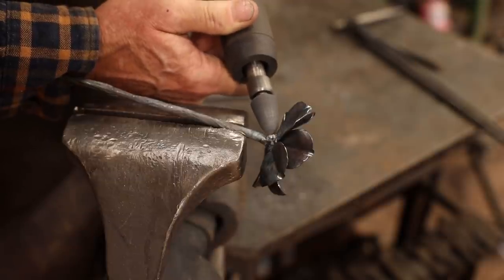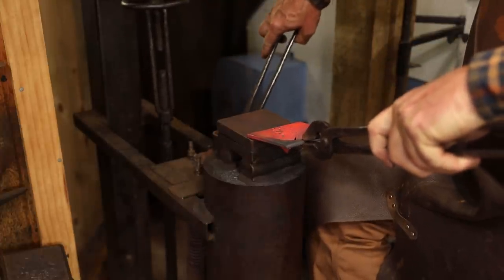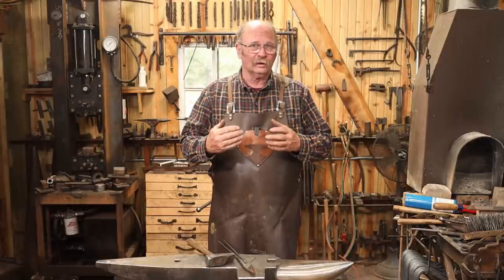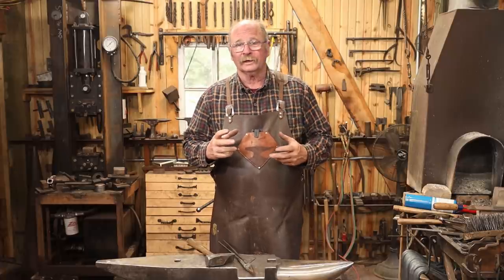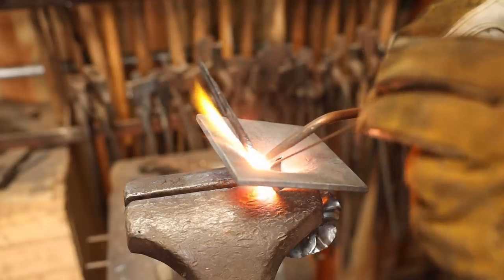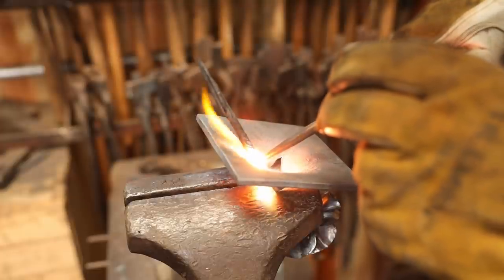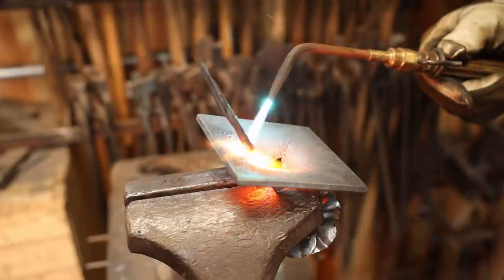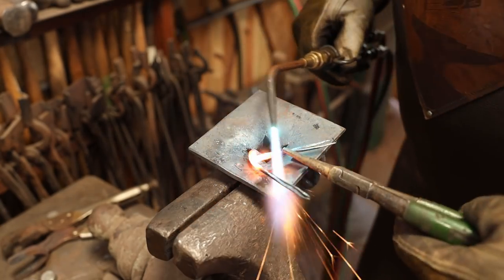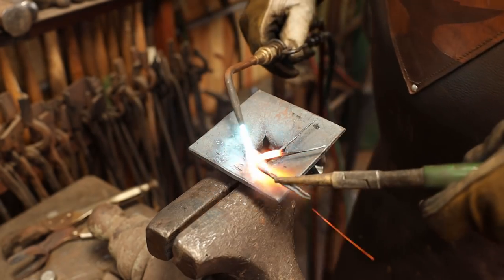I'll take just a moment with a die grinder and try to clean that weld up a little bit. I'll go ahead and add my touch mark to the plate before I weld the flower in. My original thought on how to hold the flower into the back of the plate was that the root system would do that for me, but it's so thin and so delicate that I think it's merely an ornamental element now. I'm going to weld the heavier part of the stem to the plate just before it exits the plate so it will be good and secure, then I'll put a little tack weld on parts of the roots so they can't get snagged and bent out. They're so thin they'll be really easy to burn, so I have to be super careful. As I work with the roots I'm going to try to twist them and bend them and make them look as organic as possible - they still have sharp edges from sawing but I think I can camouflage most of that.